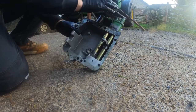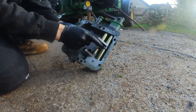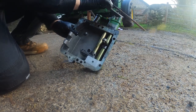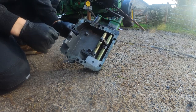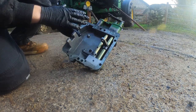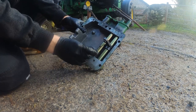Shift cover, selector forks. You see, this one is fine. It has a roll pin going through this cam shaped fork in through the pin there, and this side is controlled by the cable that goes to your gear lever. But this one, due to strain from a blocked filter, I believe, in the hydraulic system, broke.